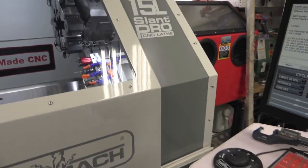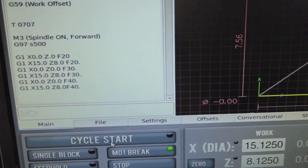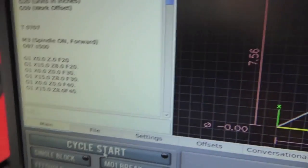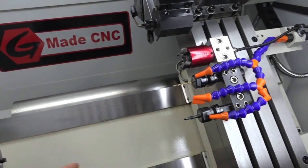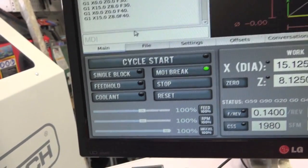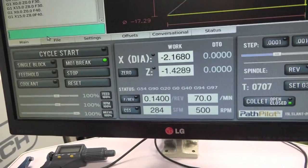All right, that was a 10-minute run — wasn't going to hold the camera that whole time. As far as the code, if I email it to you, the only thing you'd have to change is your tool — whatever your master tool is. The reason I suggest using your master tool is because once the warm-up is done, the first thing I'll be using is that master tool to do an offset to whatever part I'm going to cut. Then I just come back in here to G54 and I'm back to my regular work offsets.